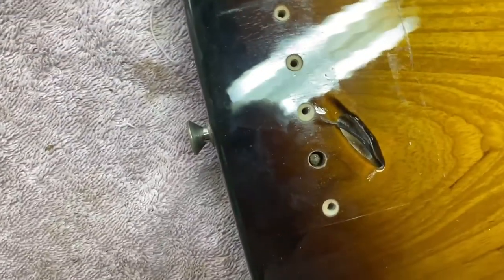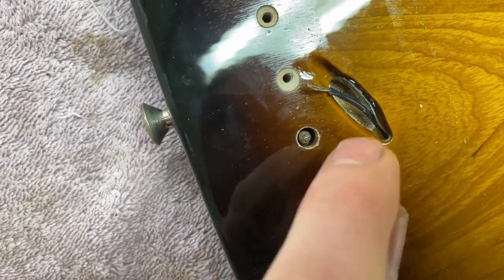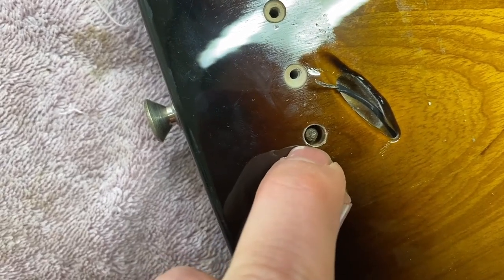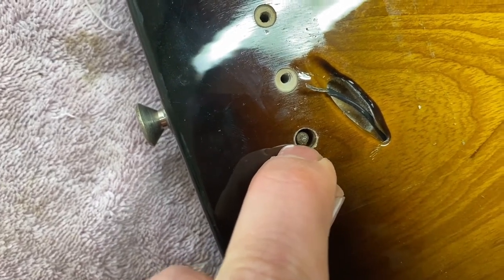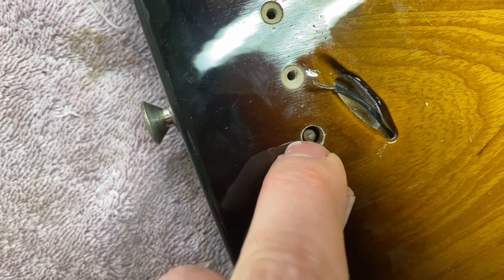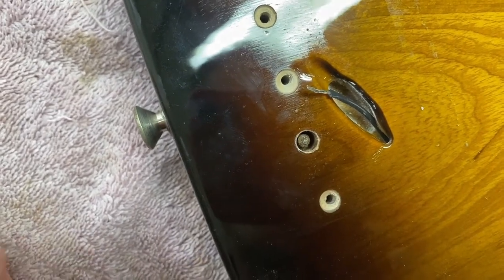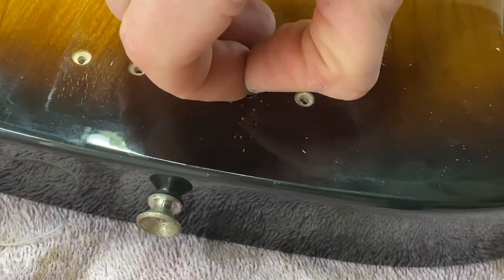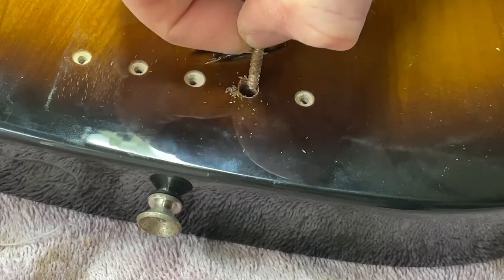After using that tool, you can see what we're left with. The screw is just sitting there - that's the screw on its own now, all the wood around it has been removed with the plug cutter. We just need to knock out this last bit of screw, which must be held right at the bottom. I can just wiggle that about and it should come out. There we go - you can see it's just come up now. I went a tiny bit deeper with the drill, and there it is.